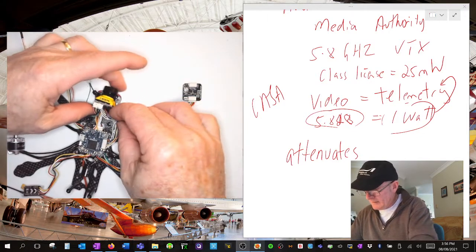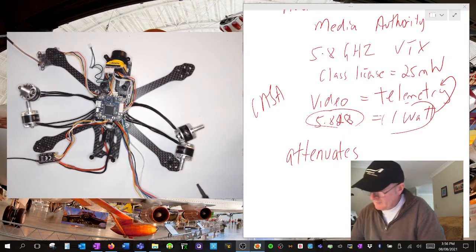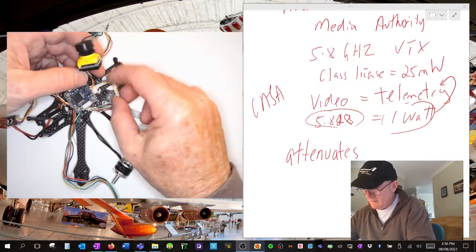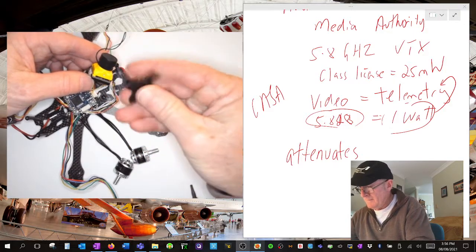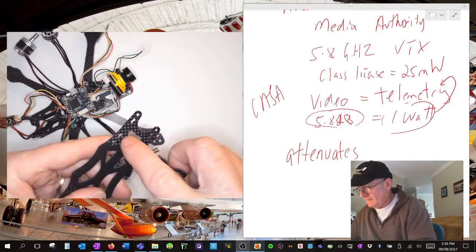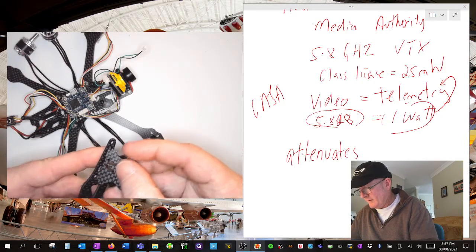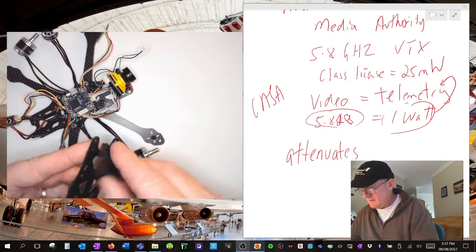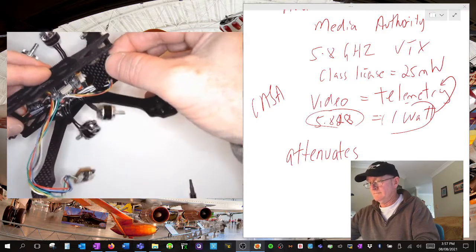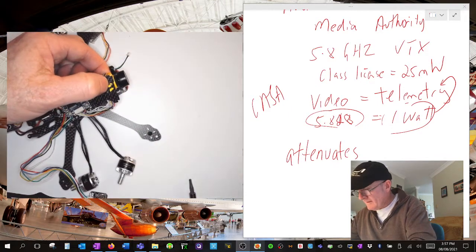From there, it will be mounting the FPV camera, mounting the motors, mounting the GPS, putting the top plate down. Camera is going to be mounted in here. Yeah, because that's the top plate. And in the top plate there's two grooves. That little battery mounting pad, the friction pad, goes on the very outside. So this will be the inside. And that will go there. Slide that. No, it'll go like that. Okay, and you mount it down onto the ground line. The camera on the inside, just there, two screws.